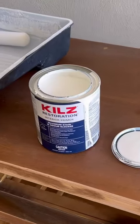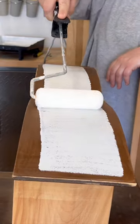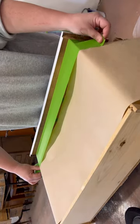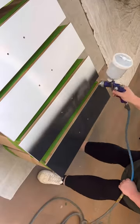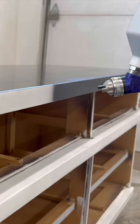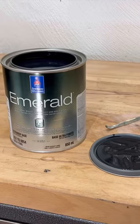You should have restored it to the original — we're a little past that stage by now, my friends. As beautiful as this walnut veneer was, this dresser wasn't ever going to be worth the time or expense needed for all that. So I primed the whole thing, masked off the insides of the drawers, and painted it in this satin black enamel.